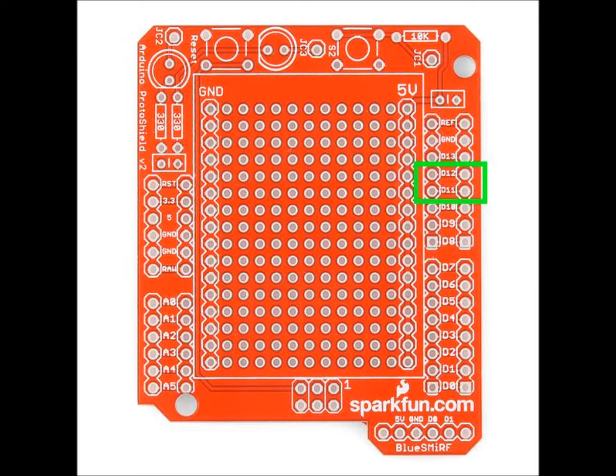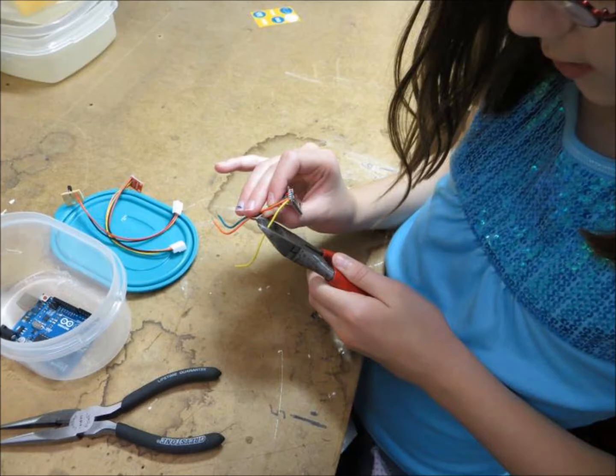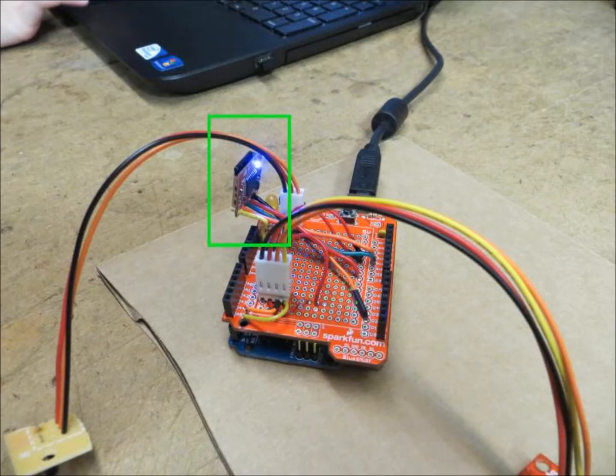As a result of that change, and our decision to wire up directly to the pins rather than using a socket, we've revised our original plan for the data logger. We decided to place the data logger off to the side to keep it out of the way of the other components as much as possible. The hookup wire was stiff enough that the logger wouldn't move much once soldered in, though we trimmed the wires down to make fitting them into their holes on the board easier. Here it is, completely soldered onto the proto-shield.